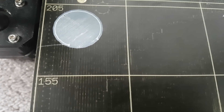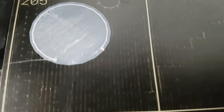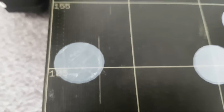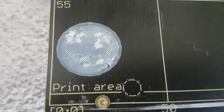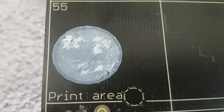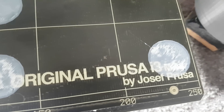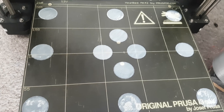As you can see at the top where it started, it's not too bad but still looks like the nozzle is pushing and mushing the filament up slightly. Coming down, pretty much the same — and look at that, the nozzle is way too close there, dragging everything up. All the way along the front you have the same issue.